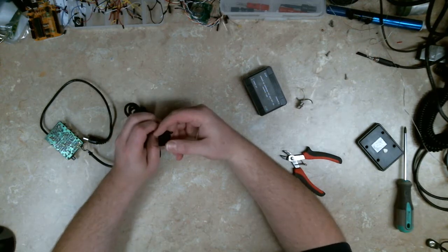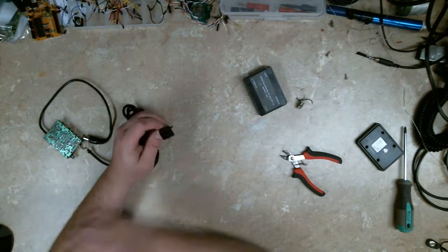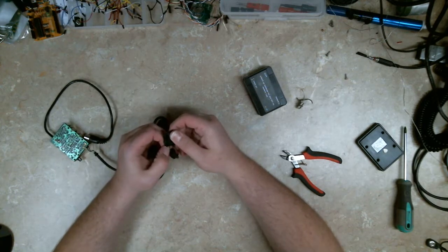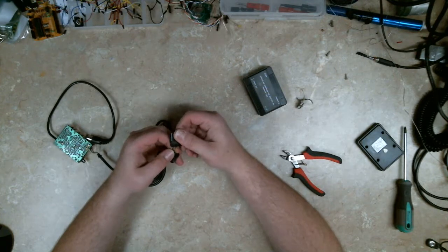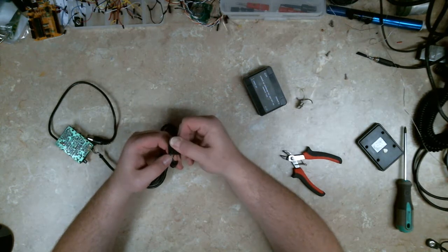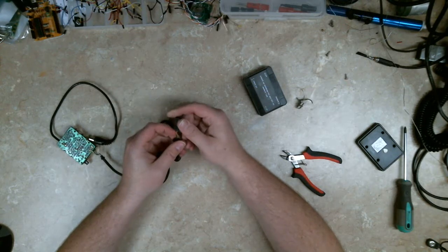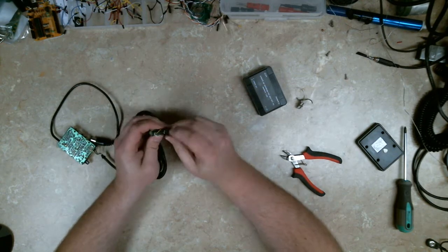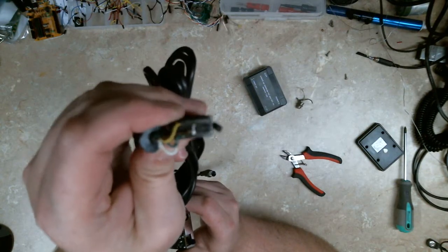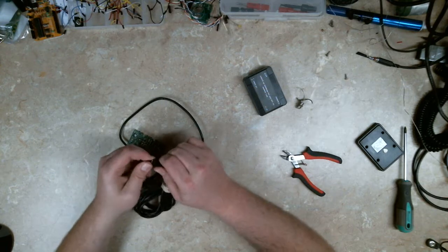So, we have the pinout here as 11. So this must be 11, and that's 12. 11, and then 9 is composite video, so it's green that's video on this one. 9, and then 8, it's chroma. How interesting. Is that 10? 9, 10. That's 10. Okay, so 10. Yellow is 5 volts. Boy, I would have really messed that up. Huh? And then, see, they've bridged these two. These two pins are 5 and 6, and they've actually gone to the trouble of bridging them even, so they really want their ground to be good. I don't blame them. Weird stuff happens when you've got a bad ground.